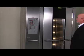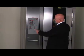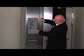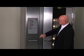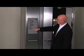You can easily change an existing recipe's settings. With the oven in the off mode, press and hold the up arrow in the steps section. While pressing and holding the up arrow, press the power on button for 3 seconds. When the beep sounds, the oven is in the program mode. Press the recipe up or down arrows until the program number is displayed.